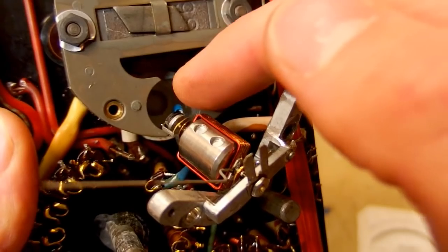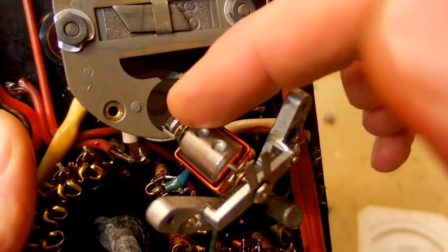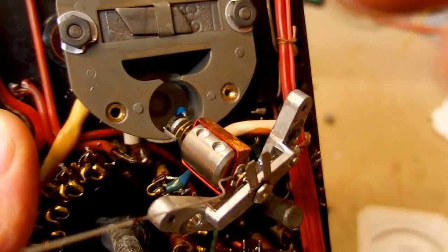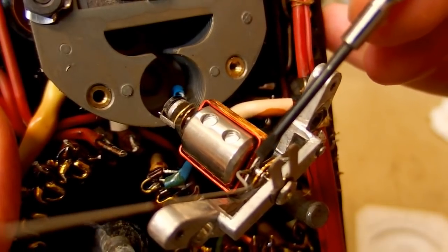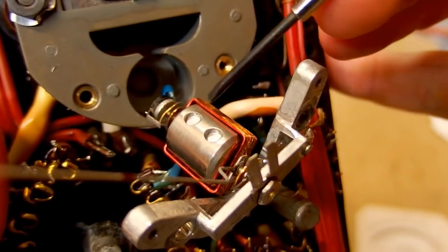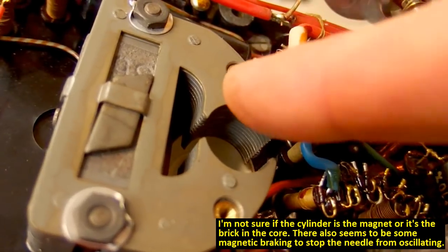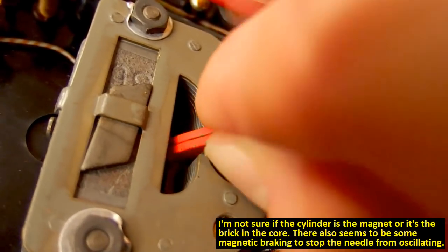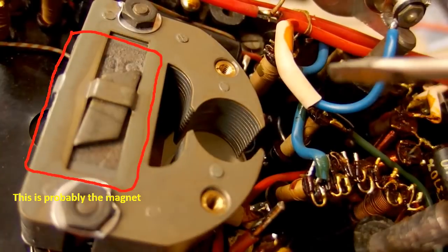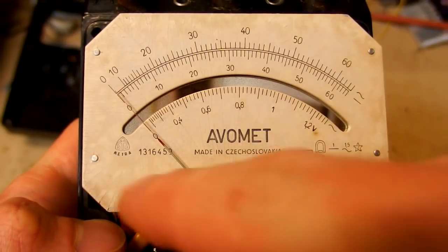I took the coil out — it was in a round hole. This is the coil which moves around a metal cylinder, and it has some bearings. There are two very fine springs, one at the bottom and one at the top, which have a double function: they move the needle back and they are also the electrical connection to the moving coil. The magnet is collecting iron dust, so let's clean it using an even stronger neodymium magnet. The small pieces of iron are attracted by the magnet and they make it stuck. Now it's moving more or less freely and not getting stuck anymore.